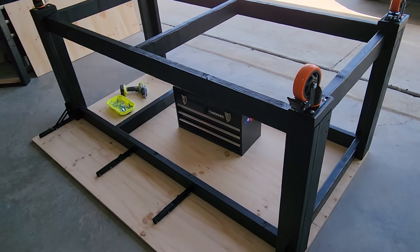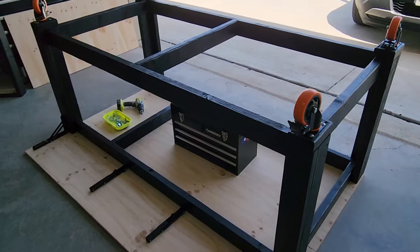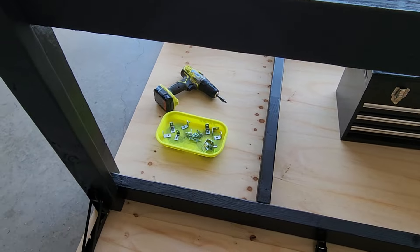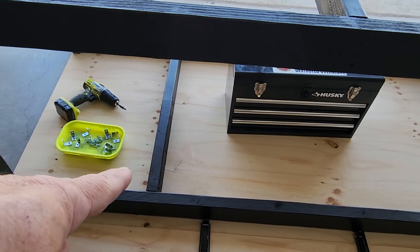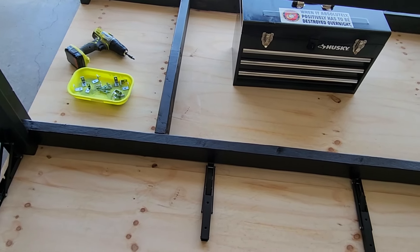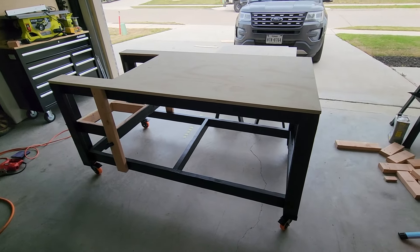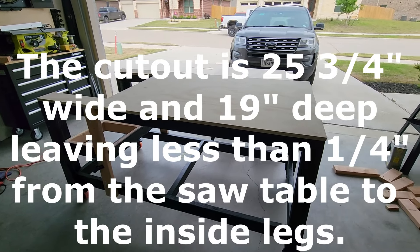Fast forward a couple of days — I've got two coats of paint on the legs, the casters are on, and I'm getting ready to attach the tabletop to the frame using 90-degree brackets and screws. When that's done I'll do the cutout for the table saw, then mount the shelf. Once I get the legs on the side that hold the shelf on the outside, I'll start mounting these 90-degree brackets so I can fold this one-foot-width section down and use it whenever I need it. The cutout is done and everything is sanded with the edges smoothed out.